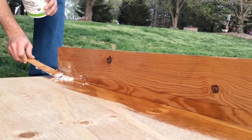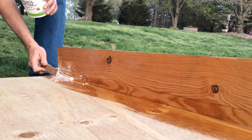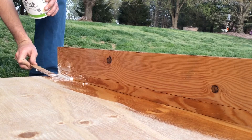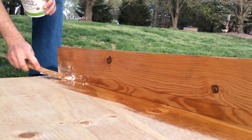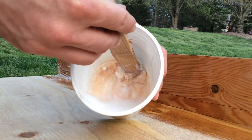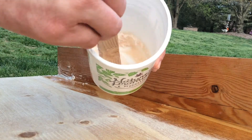The process is really simple. All you need to do is mix up the resin and the hardener per their proper amounts, mix them thoroughly, and then add the thickening agent, which in our case is a powder. The powder is added to the mixed resin until it thickens into more of a peanut butter-like consistency.